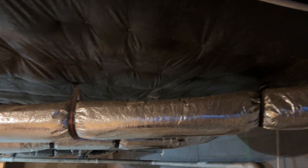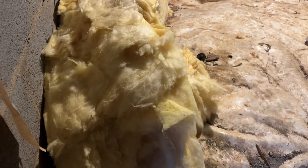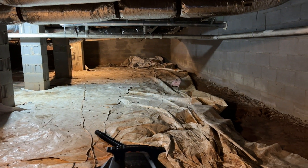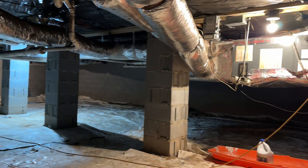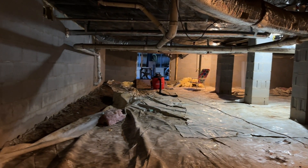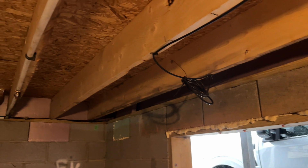The first thing I did was remove the subfloor insulation — you'll see here it's covered by a black plastic. The problem with subfloor insulation is that it comes loose over time and sags, it's a hiding place for rodents, and it can hide mold if you ever have a leak in your piping. I'm also getting rid of this loose-laid vapor barrier; it's not really doing much for moisture control, the columns aren't wrapped, it's not taped or sealed. So step one is getting the insulation out and the old vapor barrier off the floor.